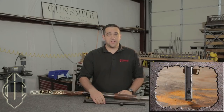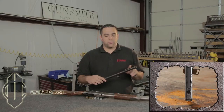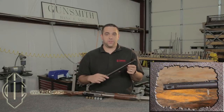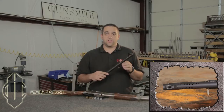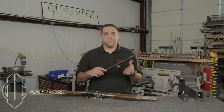Hans would then further backbore the barrel so that the shot column gradually tapered and squeezed together as it traveled down the bore towards the muzzle. Before they get to the muzzle, the hot expanding gases which account for the muzzle flash are jettisoned through a precisely calculated and rigorously tested array of compensation ports. This hot gas is discarded through 62 holes, 31 on either side of the front sight, which contributes to the flat shooting, reduced felt recoil, eliminated muzzle flip, and diminished muzzle flash characteristics of the Vang Comp system.